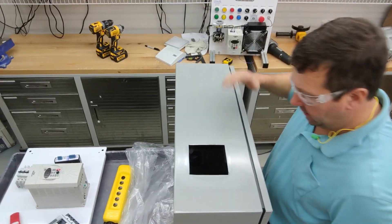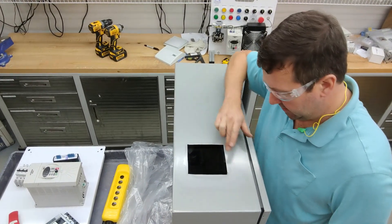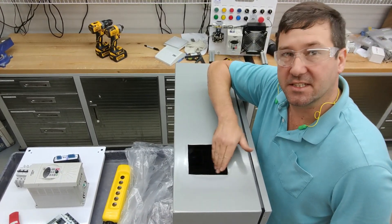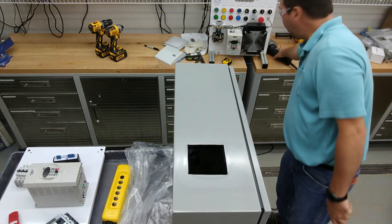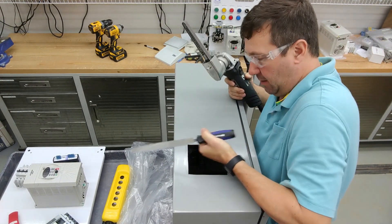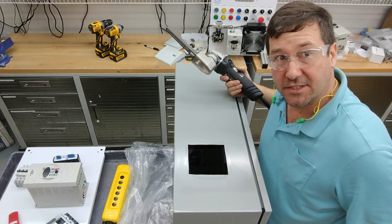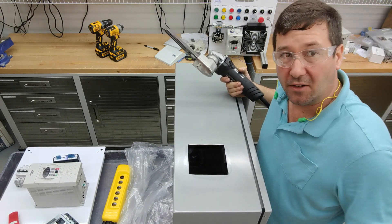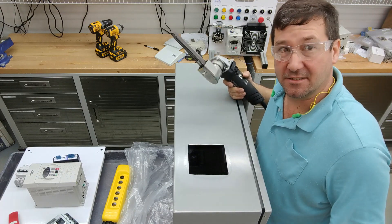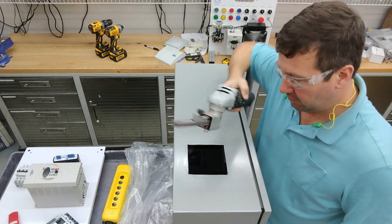Back from cutting our panel. One question we always get is: does the cut-off wheel burn the paint? As you can see, there's no real burn around it, and by the time you deburr it, it's actually just about the width of that cut. Every hole in your panel needs to be deburred. You should be able to rub your finger all the way around the inside and outside of the hole, because eventually somebody reaching in to change something could cut themselves.